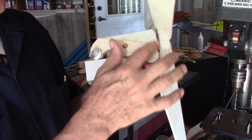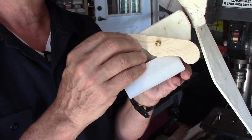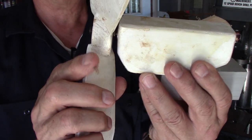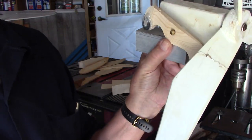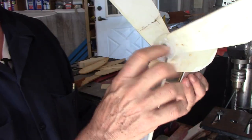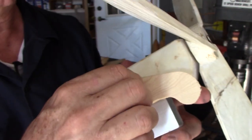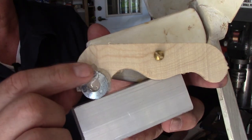On this cam, I've rounded the front so that as the blade goes by, it won't hang up or stop the blade. Also, the blade has about an eighth to three-sixteenths of an inch of play. So if it starts to hang up on the clicker or the cam, it can slide forward and ride over it with this little play in the nail. I've used a number 10 brass wood screw for the pivot on here. This could also be a nail. Inside this pivot, I've put a little brass bushing, and this washer is just hot-glued on there.